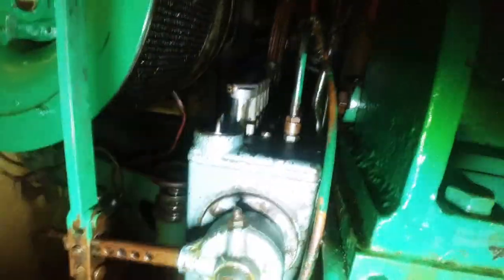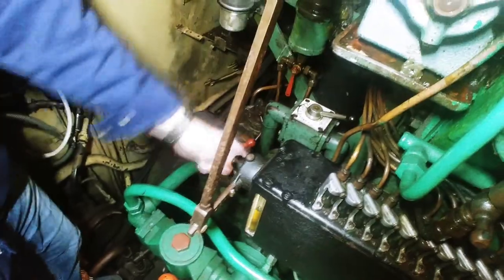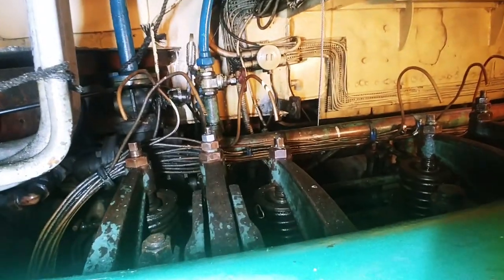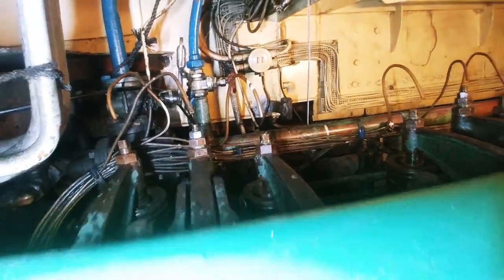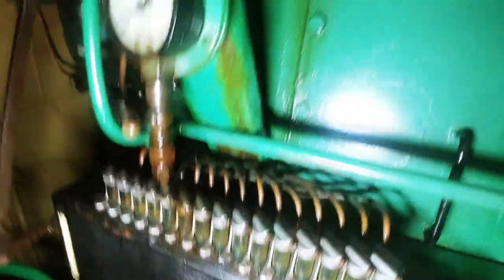This is the lubrication for inside the cylinders, so that's a small pump you're pumping there. And this is the lubrication for the valves — that's what we see dripping from the top here on the little tubes. These are all the lubrication points. You can see this one is at 15.